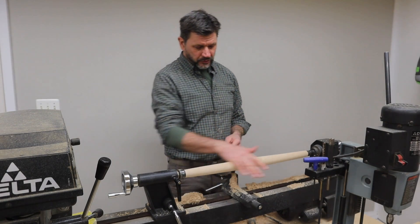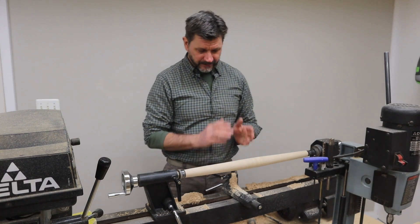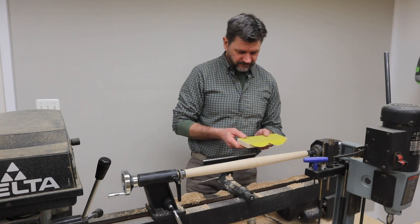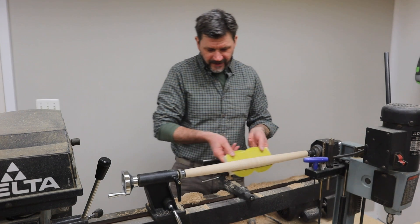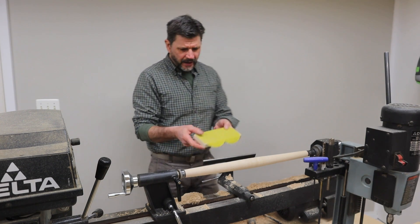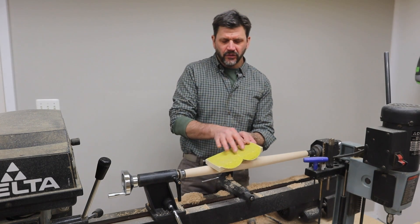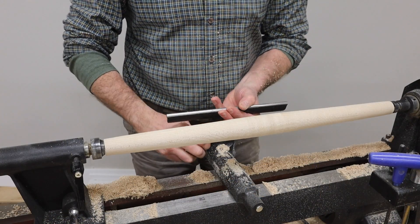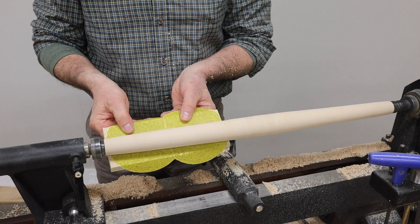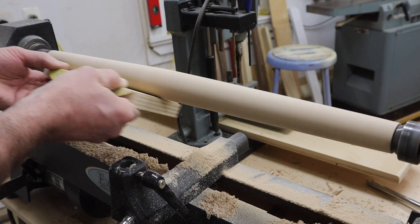You can see that I now have the general shape of the rolling pin but it's definitely not smooth. Using a sanding block — maybe it's cheating — I can already see an inconsistency where one spot is a little bit higher, but I'll be able to work that towards the center. I'm starting out with 40 grit paper on the block, removing a lot of material, and then I'll move up the grits to eventually finish sand the rolling pin with 220.